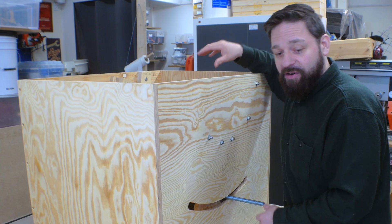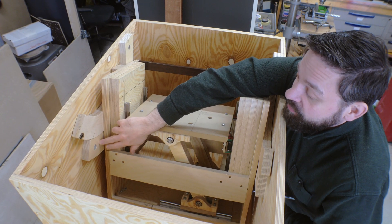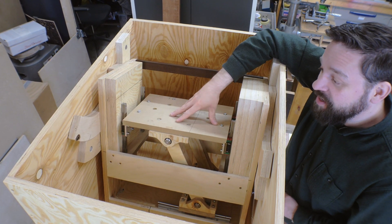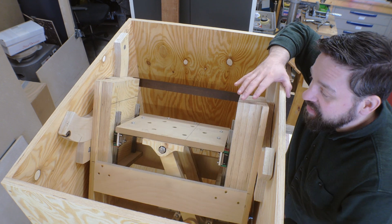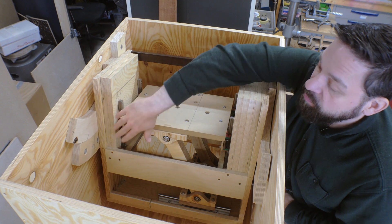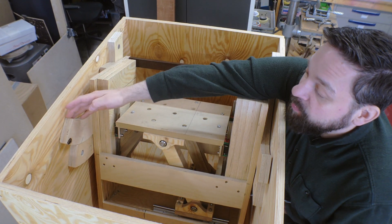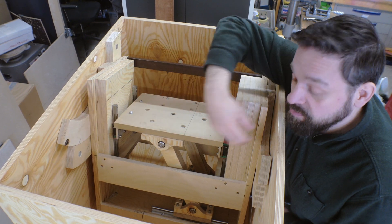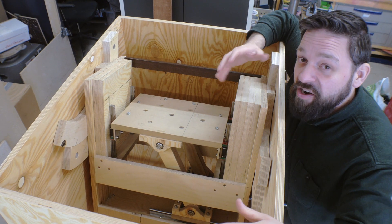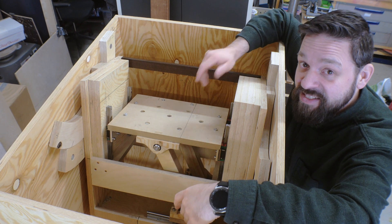And if you look up in here, I thought I could get away with only having the lower curved rail and the top curved rail, because there is a lot of weight down here. But as you can see when I try to drive it, it's moving and lifting up from the bottom rail — that can't happen when this is finished. So I need to make a curve to have on the top here on both sides as well. There are also a couple more changes I want to do, but that will be in the next episode.